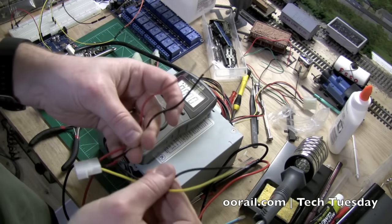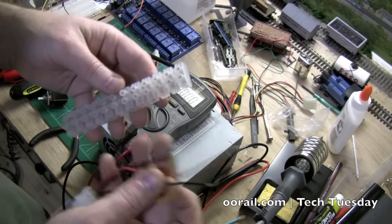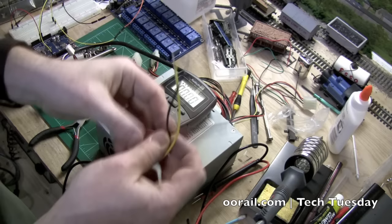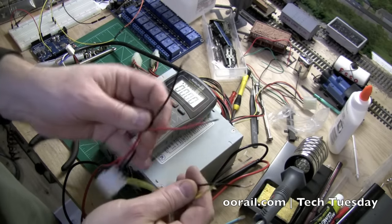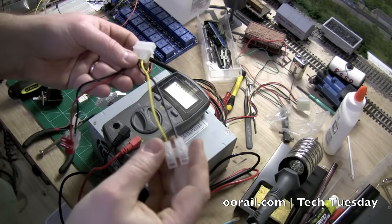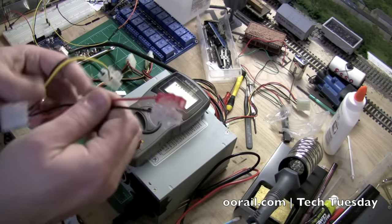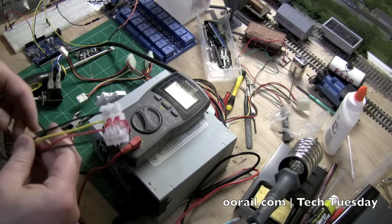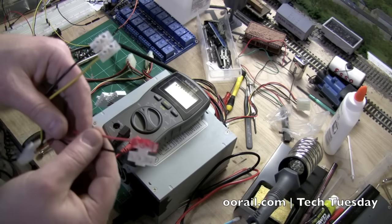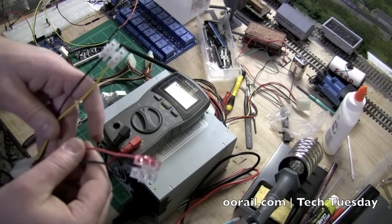Now we've got our two pairs, so what we're going to do next is wire these into the terminal block — basically one of these things. We're going to wire them into two separate terminal blocks just so we don't get them mixed up, and then we'll have the start of a 12 volt and a 5 volt bus that we can use on the layout. So what I've done here is I've wired the 12 volt supply into one terminal block and the 5 volt supply into a different terminal block. I've taken a Sharpie marker in red and coloured in one side just so I know visually that that is my 5 volt supply — that way I won't accidentally get them confused when working late at night.